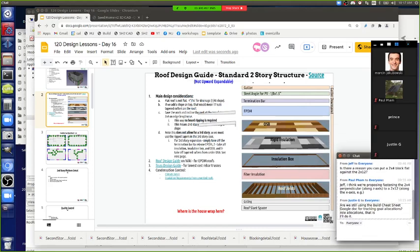So that's just plain 2x4s. Once again, with the half inch, because the insulation is 2 inches plus 2 inches, so it needs to be 4 inch. The rigid insulation has to be two layers of 2 inch thick insulation. And the reason for that is when you have that much insulation, you're going to avoid condensation on the underside of that insulation, because the thermal gradient has enough heat trapping that you never get that cold where the fiber insulation ends up.